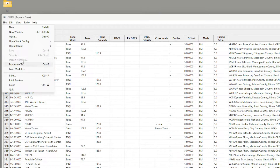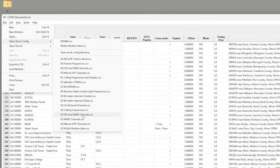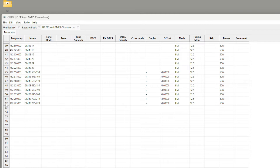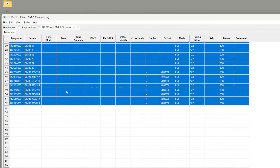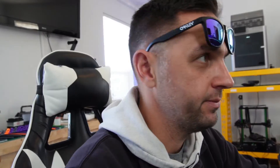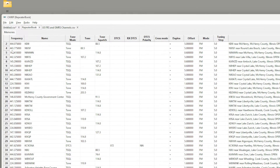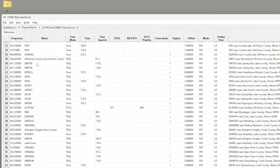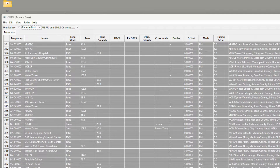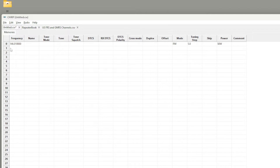I'm not your mother, so do what you want. If you were to do what you want, this is how you would do it. You can go to File, Open Stock Config, go down to things like FRS and GMRS, select channel one, bring it all the way down to channel 52 while holding Shift — it selects them all. Copy with Edit > Copy or Ctrl+C. Then go back to your file. Let's go back into RepeaterBook, hold down Shift, select the first row, go to the bottom row, select those, copy them, and bring them into the CSV where we'll paste them.